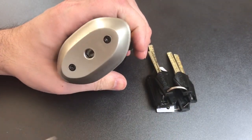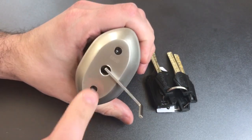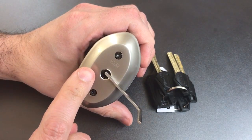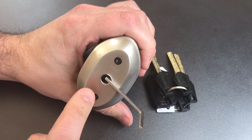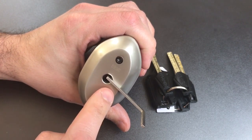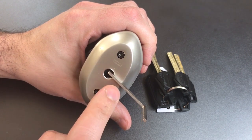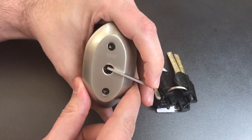The lock in here is a 10-slider core — five on the right, five on the left. Each slider controls its own separate sidebar. I've picked maybe four or five of these cores in the past, and in every single one, the bank of sliders on the left will bind before the bank of sliders on the right. So that's the one I go to first.